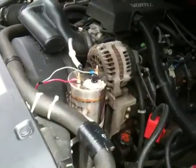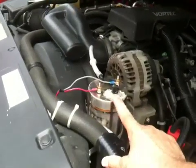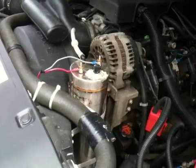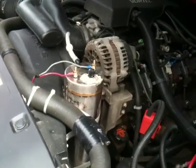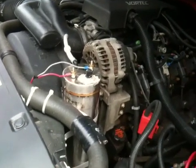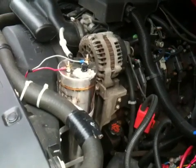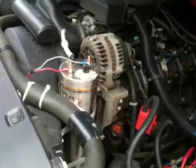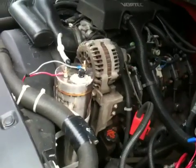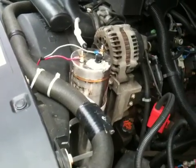If it wasn't for the overheating it would probably be a good deal, but I have to change the KOH in this unit every few days depending on how hot it gets. In four days it's going to get back up to 95 degrees — right now it's probably only about 80. I'll probably have to change it before then; I just changed it maybe three days ago. What happens is it cooks the potassium hydroxide inside of the unit.